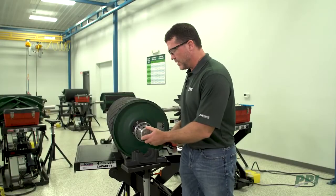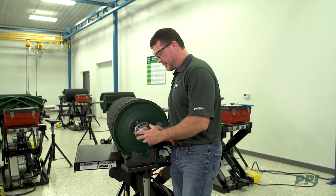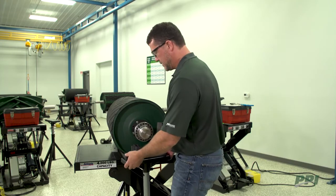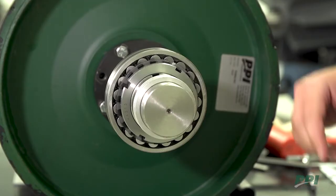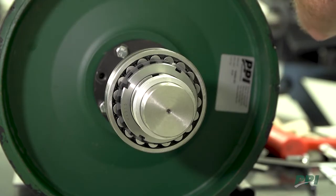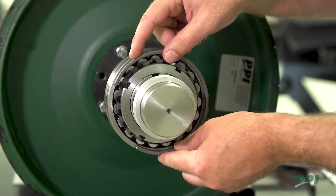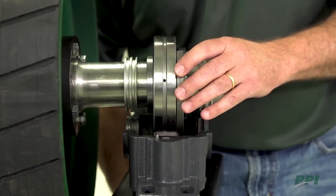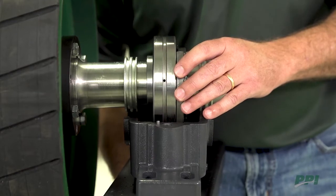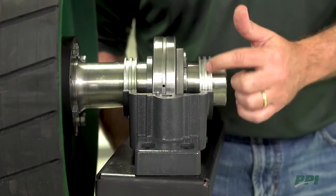Next, it's time for our outside LER seal. We'll put it in its approximate location, then mount it into the bearing base. There's a held and free end on these bearings — if this were the held side, we would be putting our stabilizer ring in now, sliding it near the locking nut and the outer shoulder of the bearing housing. We line up our LER seals with the stabilizer ring in place, lining up all of our grooves.